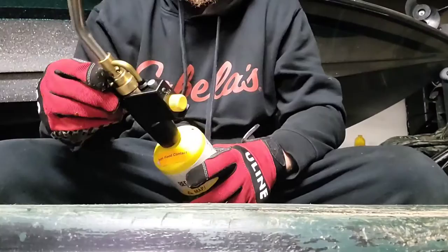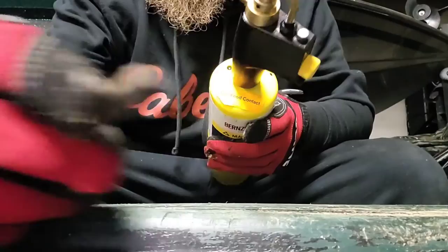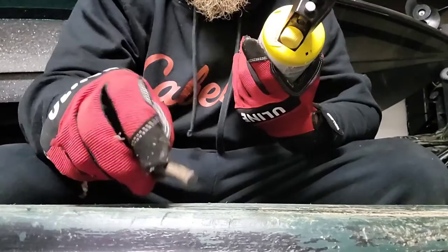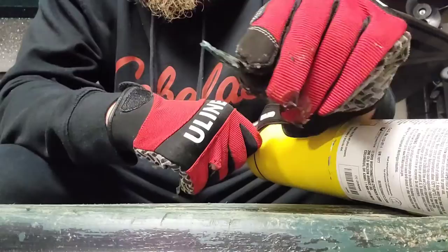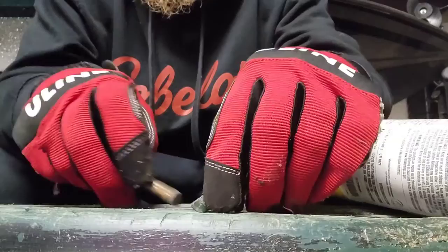The hole's right here. So what we're going to do is take the back end of this drill bit and heat it with the torch — get it blistering hot. We're gonna start by heating the hole without using our filler piece, melt the hole down a little bit, get it nice and soft, try and fuse a little bit of that together. Then we'll come in with a little bit of filler. I just cut a little piece off — that's all you need. We'll just fill the gap in a little bit and call her a day.